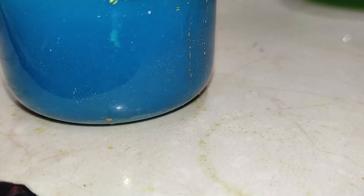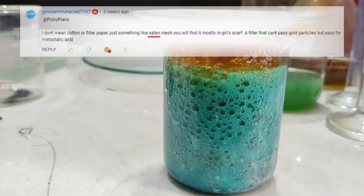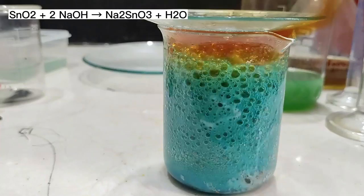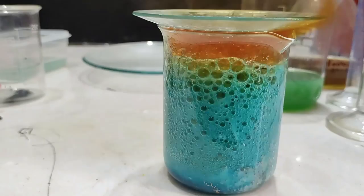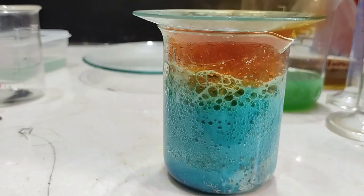Now to separate metastannic acid and foils, I'm going to use a trick that one of my subscribers mentioned. You can use satin mesh, Hussam Muhammad said. I've already had experience dissolving metastannic acid or tin oxide hydrate in hot concentrated sodium hydroxide to make sodium stannate. But it needs high temperature and it's not possible to do in glassware. There is another point that I remember from the experiment. When you alkalize the solution with sodium hydroxide, metastannic acid turns into nanoparticles. So I thought it's good to alkalize the solution. That way I can easily separate gold foils from nanoparticles of metastannic acid using a satin mesh.